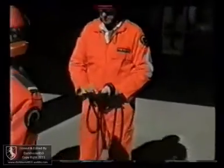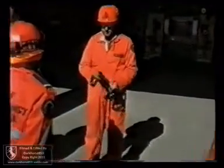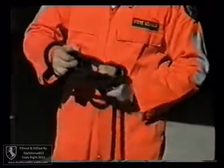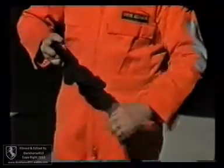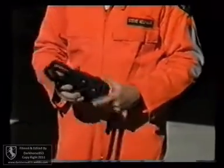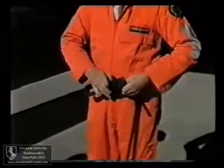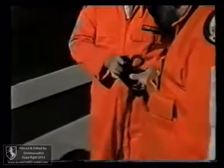Right, and normally you just pop through there, and that's your figure 8 on the bite. But instead what you do is you pull that through, and then put that over the top of those 2. So that's why you end up with 3. Right. So you end up with 3 at the bottom, 2 across there, and 2 up here. Okay, that's different to what I thought you did. I was thinking that you'd done it actually as a figure of 8 on the bite. No, basically doubled it on the bite. Just dress it around.